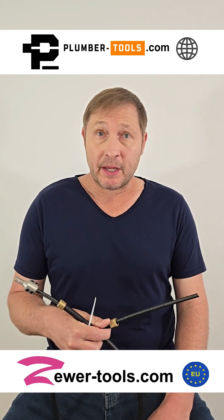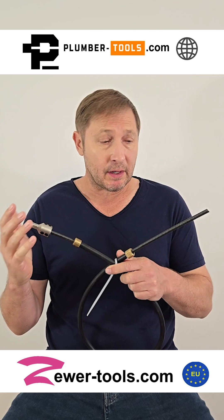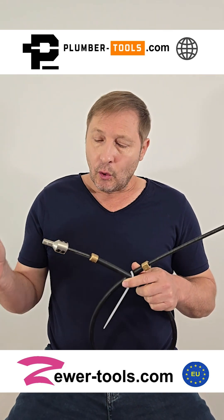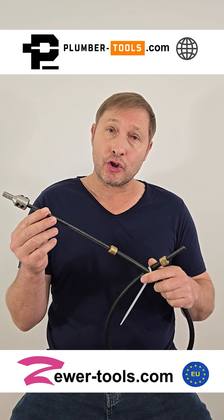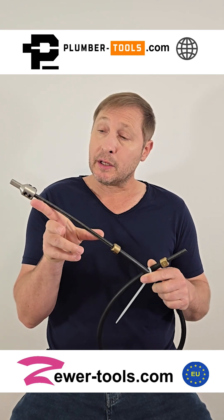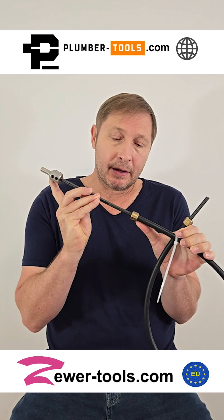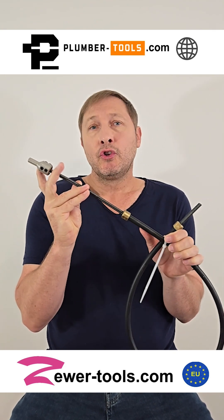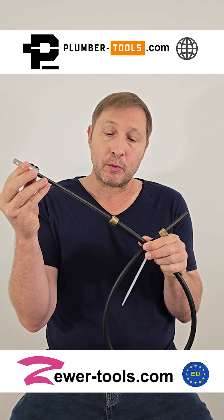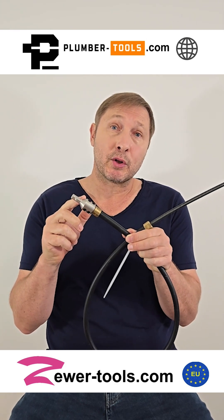To prevent your shaft from kinking, you will notice that you have a drill end and a tool end. When the drill end has more exposed shaft between the drill-to-shaft adapter and the sleeve bearing, this is the most likely place where the shaft will kink. To prevent that, you want to keep your sleeve as close to the drill-to-shaft adapter as possible.